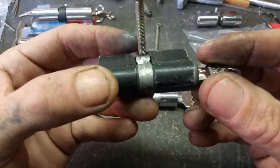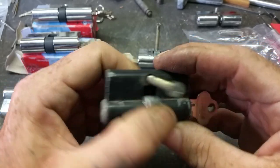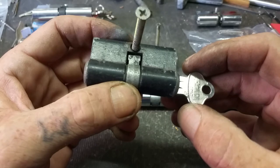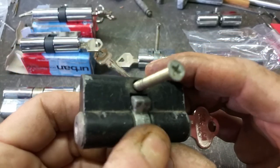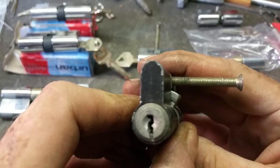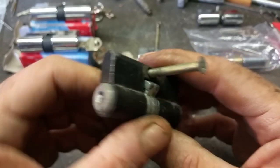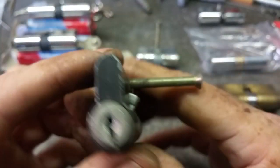This one's the Austral five-wafer Lazycam. These are more popular on the Austral screen door lock sets. Some of them actually have a spring inside that cavity — a locator spring — that keeps the cam in position for the function of the lock. Any problem with that, you'd rather take the door furniture off to get the cylinder out, which is no big deal.